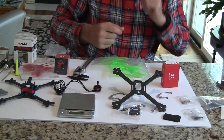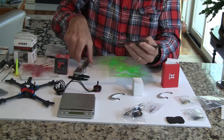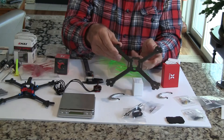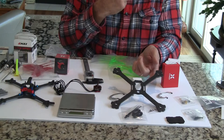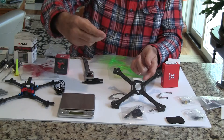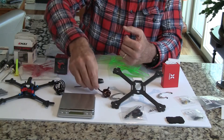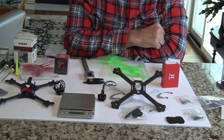By using the smaller stack they could get by with a smaller frame for five inch props, which helps with the weight. Anything you can do to reduce it gives you a lighter and stronger build. The bottom plate thickness is 4 millimeters and the arm width is 12 millimeters. The Floss had an 8 millimeter width, so these are a little wider. You can't replace the arms since it's a one-piece frame, but having them wider should be fine. I'm going to use the Hyperlite 2205 by 2522 kV motors — these weigh 27 grams each, so you're probably looking at around 100 grams for all four motors.